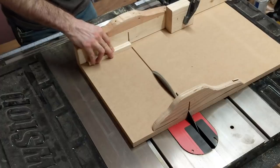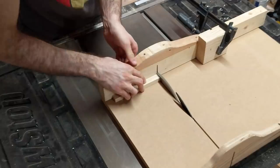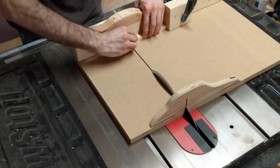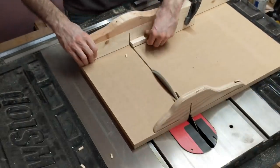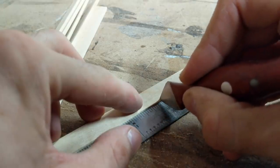The stock I'm using is 1 1/8 by 1/2 inch, and what you've seen me do so far is rough cut the six pieces to just over 6 inches long, and trim them to exactly 6 inches using my table saw, cross cut sled, and a stop block. The next thing to do is cut the half lap joints that will tie this grid together.